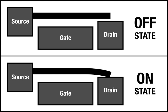NEM relays do not rely on the electrical properties of materials to actuate, so a mechanical computer utilizing NEM relays would be able to operate in such conditions. NEM relays have been successfully tested at up to 500 degrees Celsius, but could theoretically withstand much higher temperatures.